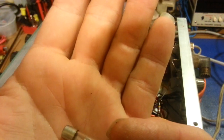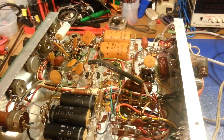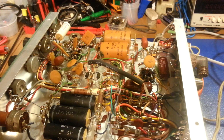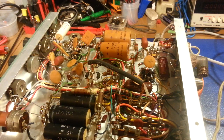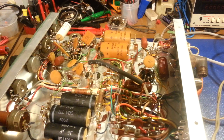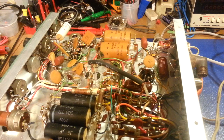That's a good thing. You have to remember these fuses have a little bit of spring tension on them. The unit itself electronically — all the caps are going to have to be replaced — but other than that it's in really good shape, put together well. I don't see any unsoldered connections, which is something you commonly find on Heathkits or any kit equipment. It's neat and put together well.